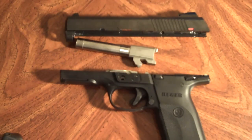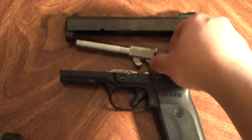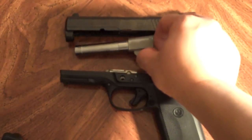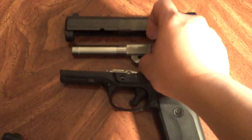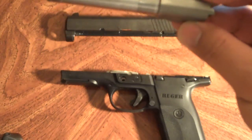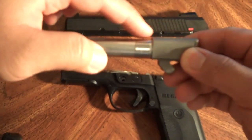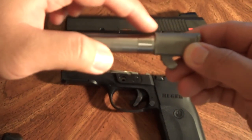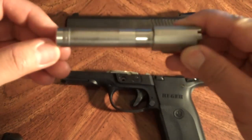Basically, it's a very, very reliable gun. I should mention that there was a little bit of an issue with the barrel — though it's not really an issue. This is a post-recall gun, and I do know through the forums that they had issues with some of the barrels peening. I have not had that issue. This is usually the top part of the barrel, where the barrel would hit the breech, is basically where people were having peening.